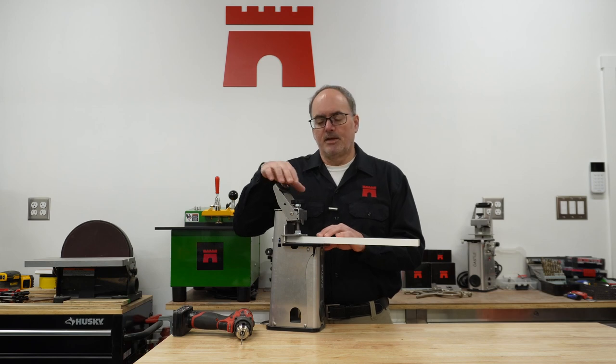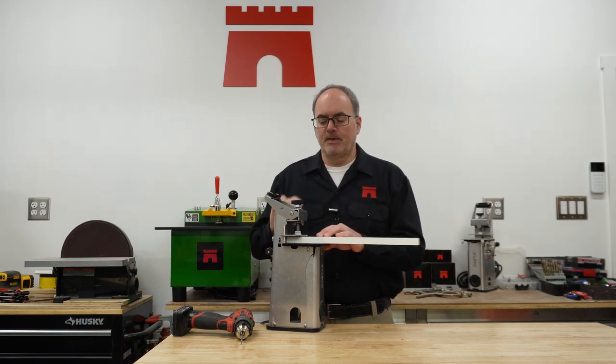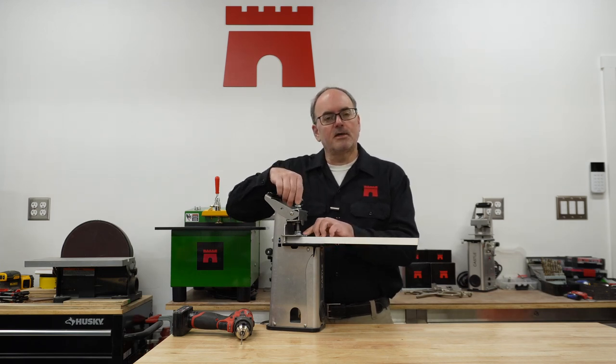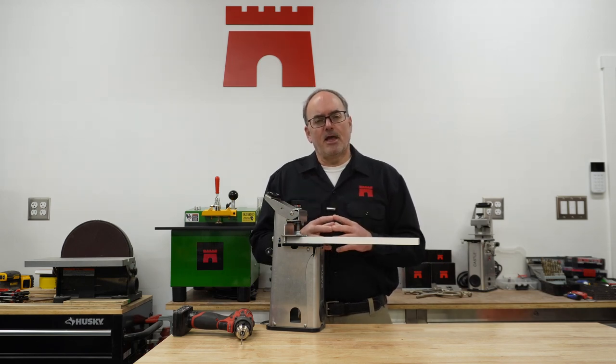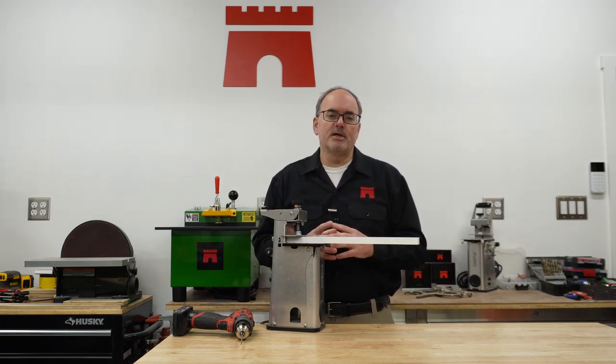enough room. Now we can move our clamp lever to the stock thickness adjustment position and turn the stock thickness adjustment knob clockwise until the clamp plate touches the workpiece. In general, at this point, our stock thickness and clamp pressure are going to be correctly set. Push the clamp lever down to firmly lock the workpiece in place.